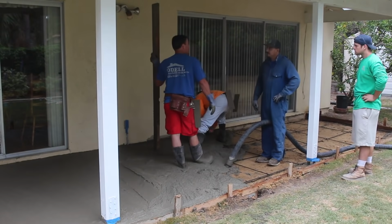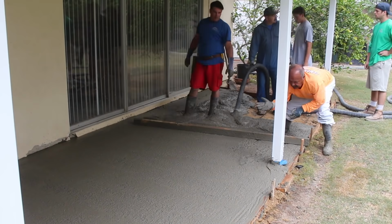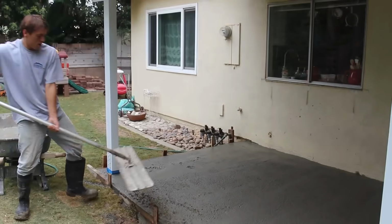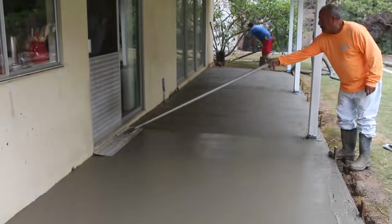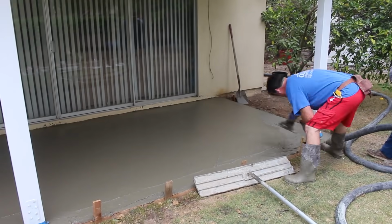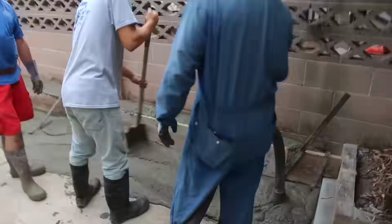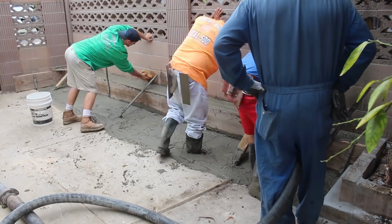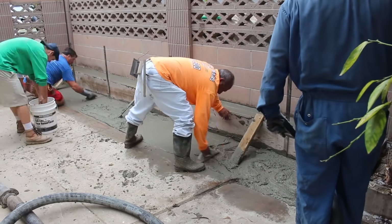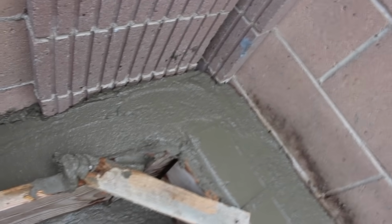We'll put a little tape around the bottom of these posts to keep them clean as possible when we're pouring. There's a little stucco damage there. On this side over here, we have the rebar running all the way under the curb, and then we've also doweled it into the concrete on the side here. That way it'll never move independently from one another. Throw a couple kickers here and there, and then I'm just going to kind of slope it down to meet the other concrete right here. Even though the form's high, we can just freehand it on the inside edge.